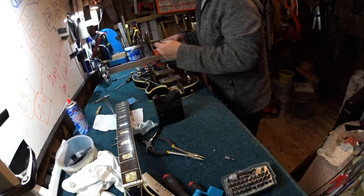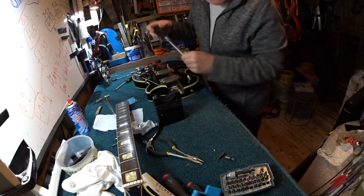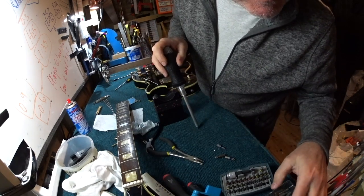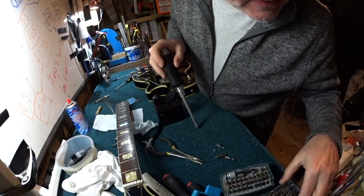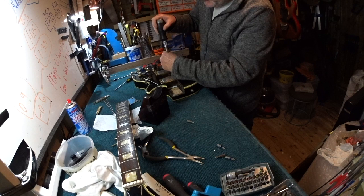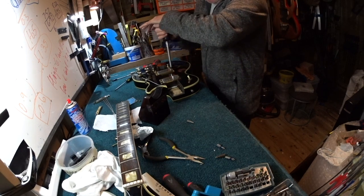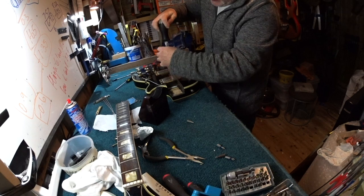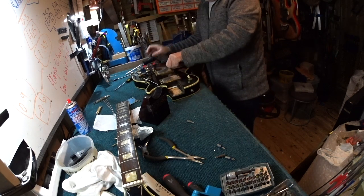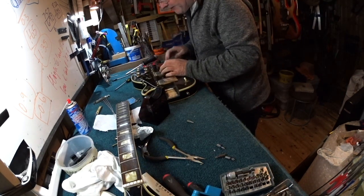No, they just do not want to do anything. I don't know why that is. It's often the trouble with older things. They are worn a bit. I can practically just about get this one out with a lot of downward force. It's just as well because we can replace it. It looks like when these rings have been put on, these have been put in with a pilot hole that isn't quite big enough because they've gone in really tight.